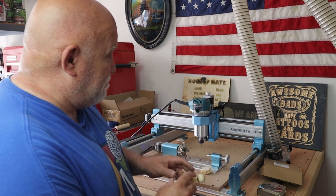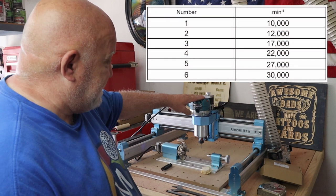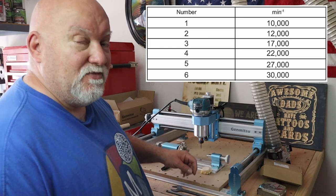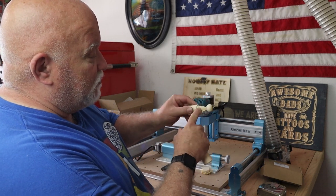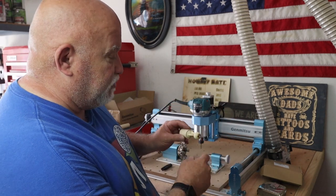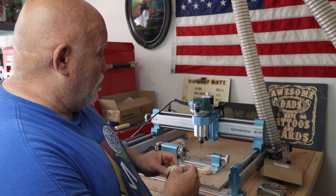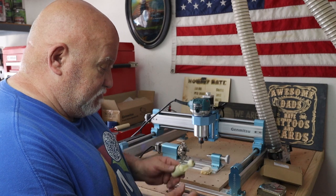The reason you see burning is I'm running the bit on speed setting four on the Makita, and I had a bunch of failures with this bit so it kind of burned up. The bit was almost bad when I started this job. It was looking beautiful at first, then it starts going brown and I just let it run to see if it'd complete the job — and it would have, but I'd have to throw the bit away. It's a 1/8th upcut spiral bit, and it almost finished.